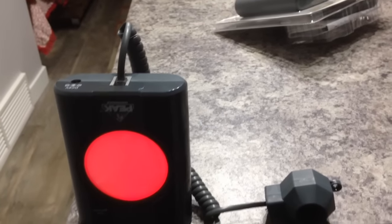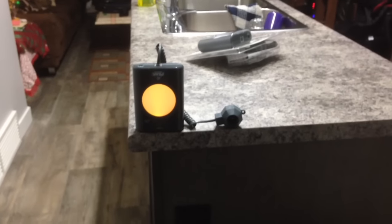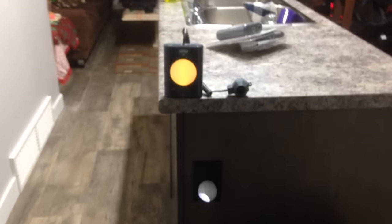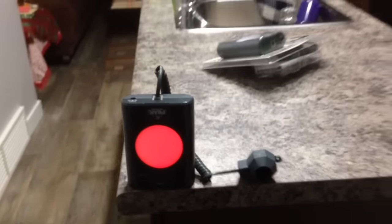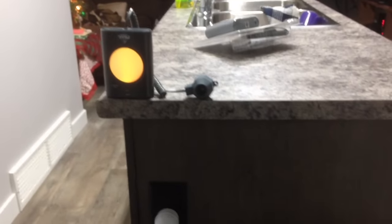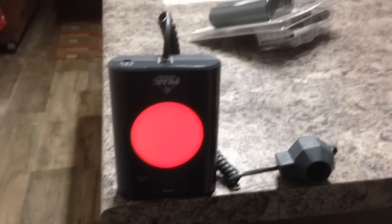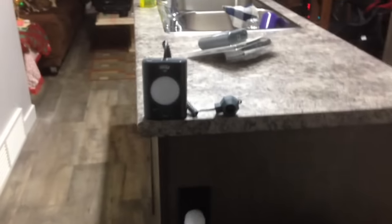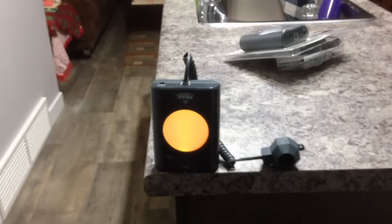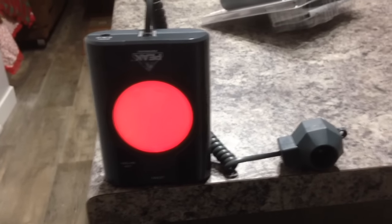You can see how it's detecting range, not necessarily motion. You can imagine how effectively and differently you could use this as a prop trigger — solenoids, things mounted on walls, no blinders needed. You can leave the sensor right out in the open so people know what they're doing to activate the props: animatronics, pneumatics, air pumping — you name it. And at that low voltage, you can use this standalone without any relays.